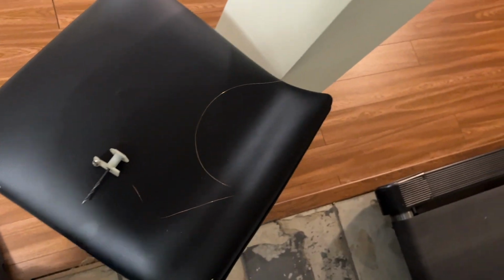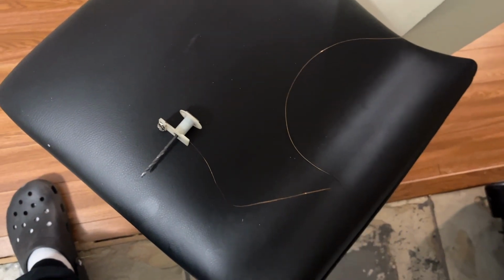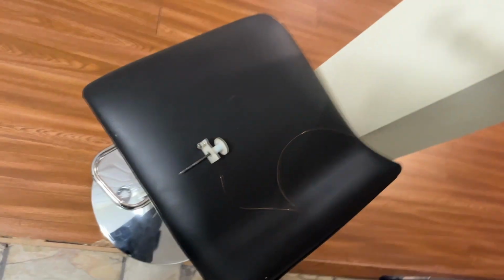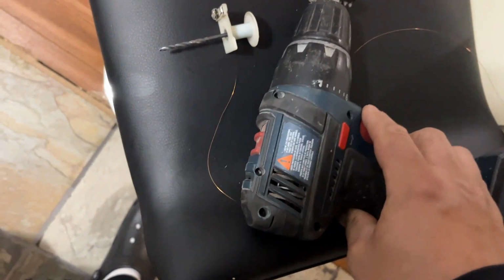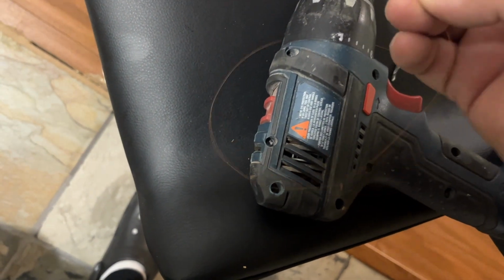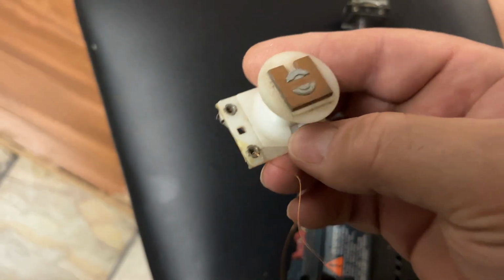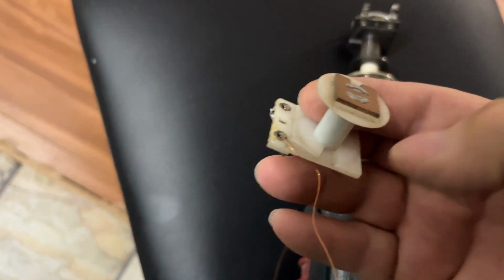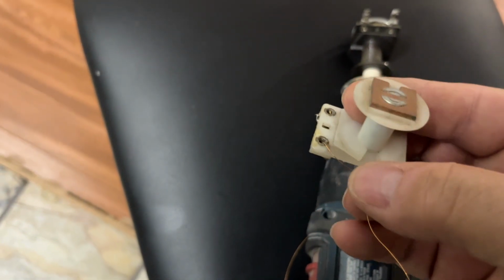So we fell short here, but again, let's throw some caution to the wind, see what happens. In a perfect world, I would have had too much on this bobbin, then I could have cut it off. But let's see, I'm guessing 5 ohms. Who knows, it might be even more. But let's just see where it goes. So what we're gonna do now is I'm gonna cut this here, and then see how it's got this lip. I'm gonna feed it under the lip and then we're gonna start our revolving. Okay, so let me just do that and I'll bring you right back.